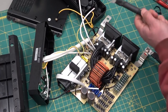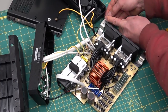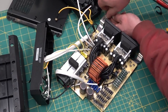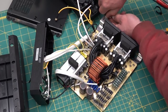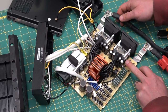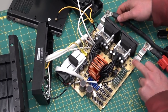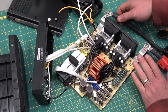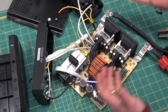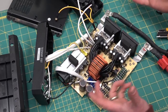Now we're going to get this hooked up to a battery. Of note, there is no reverse polarity protection on this. What happens if you mess up your leads? You fry it right away. Why you fry it right away is part and parcel of the manufacturing of this thing — it doesn't have any input protection. We could have a whole bunch of diodes in here that would prevent any damage if we reverse the leads, but they've omitted that because that's a cost, and also if you connect it up wrong, well, there's no warranty for that. You're done messed up.